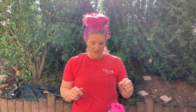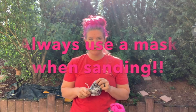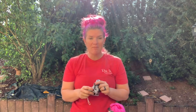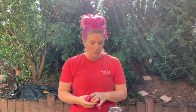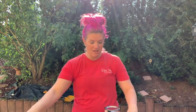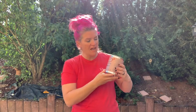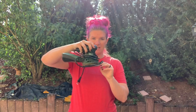There are a few things you'll want today. Because we're going to be sanding, I like to use a mask — you always need to use safety precautions when working with furniture. Anytime I'm stripping furniture I use gloves, but we're not stripping today. I always use a mask because inhaling dust when sanding is harmful to your health. You'll want a rag, Dixie Belle's No Pain Gel Stain in Walnut, and my orbital sander.